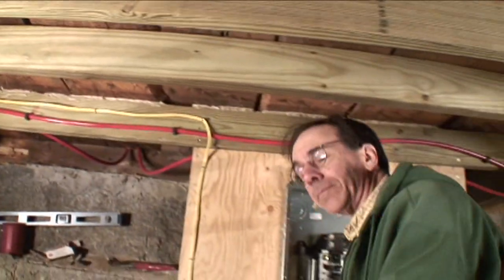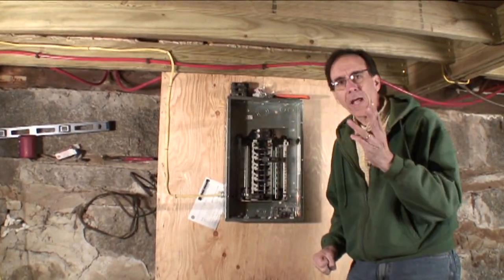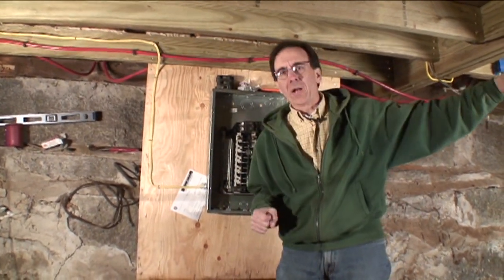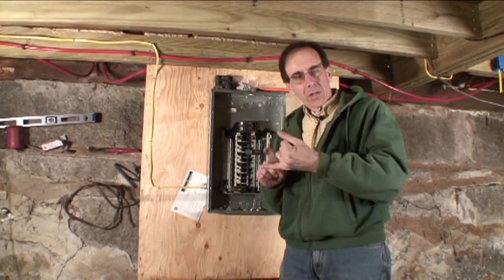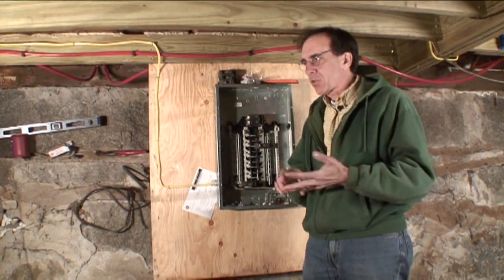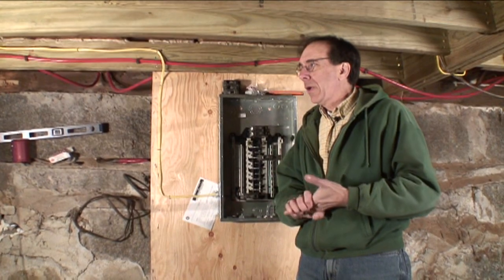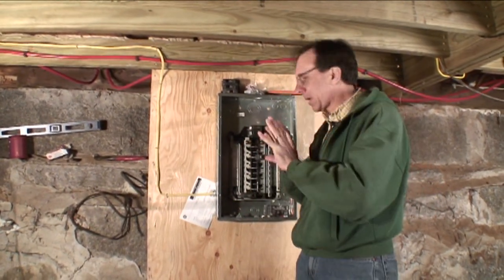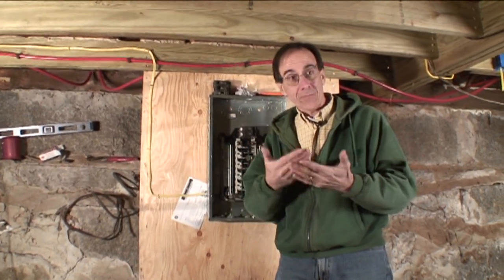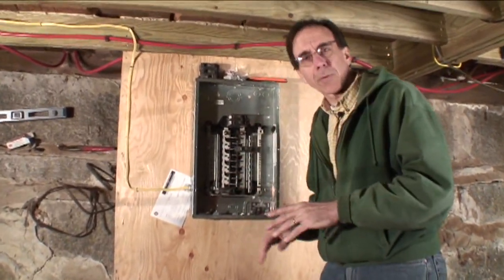This particular circuit I have wired up goes to the new outlets I put in the kitchen. There are three outlets on this breaker. There's another breaker for the kitchen counter outlets, which has a GFI on that circuit. Then we have a separate breaker for the refrigerator, and a big breaker for the stove. That's four circuit breakers feeding the kitchen — we have a lot of appliances in there.